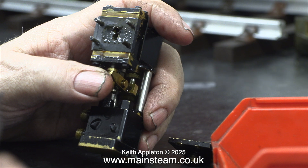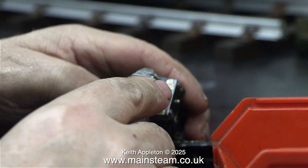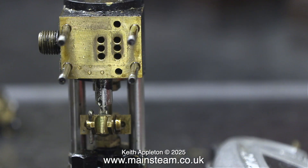This clip shows the pump with the steam chest cover removed, and this gasket is not right at all. You must never leave the material of the gasket unsupported in the centre, so what I'm doing here using a Stanley knife is removing it. The two slide valves are a bit of a rattle fit and they really don't feel very good. This is a bit of a worry — the port face is a mess.